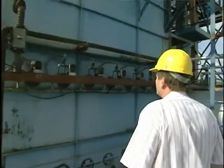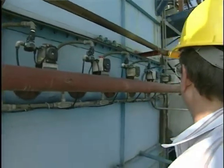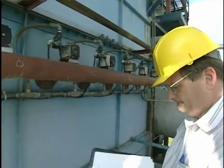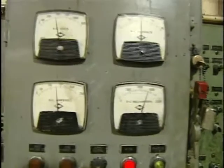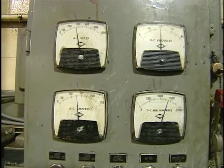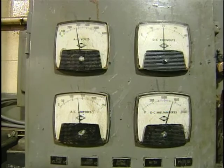Changes in electrical data that occur in a single field are indicative of an electrical or mechanical problem in that field. A significant decrease in voltage, together with an increase in current and an increase in sparking rate, may indicate a misalignment problem. Cycling of the voltage, current, and sparking rate can be caused by a broken discharge electrode that is swinging in the gas stream.